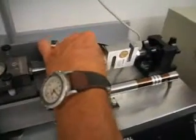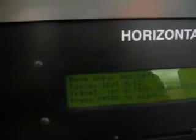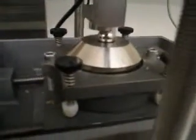Now we apply the shear box under the vertical load. To do that there are several steps. We need to make sure that the bolt to the left of the sensor is tightened, and we need to back off significantly on the wing nuts on the end so there's plenty of room to move. Then we go to the horizontal centering system by going to positions — we're going to have to move to the left — so we hit 1 and enter, and we wait and watch until the little ball is centered.